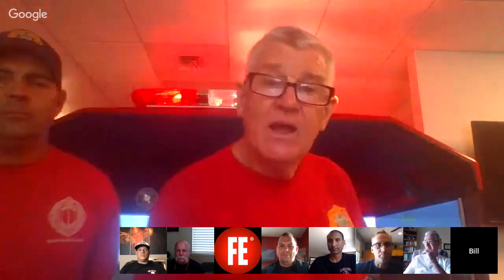Chief Halton, could you tell a little bit about yourself and maybe a pumping mishap? I'm the second-oldest person — Bill is three weeks older than me on this call. A couple of things come to mind: hose construction matters. How your hose is made is really important. When you're talking about Key Hose, obviously made to the highest quality standards, look into the construction of the hose you're buying. Also the liners — various liners can have different friction losses. Be careful about charts and numbers; always flow test your hose. Pressure testing is excellent if you're going to be using your hose as an airbag, but flow testing is probably much more effective to see your actual friction loss.